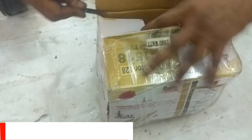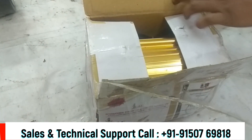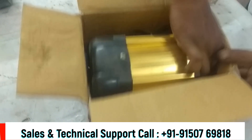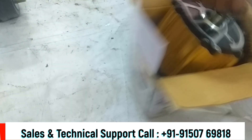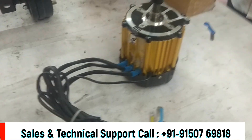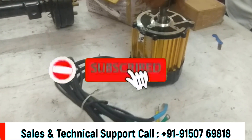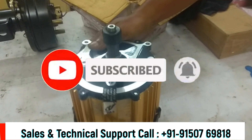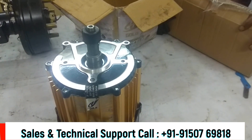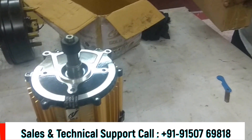No-load current listed. Rated current is 33A. Rated speed RPM is 3000. Rated torque NM is 5.2. Maximum output torque is 18 NM. Rated power is 1500W. Maximum power output is 2500W. Efficiency is 83%. Number of poles is 8. Motor diameter is 145mm.